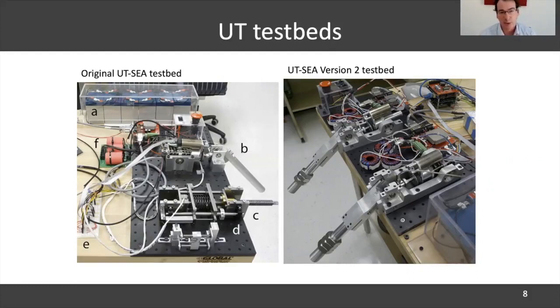In particular, here are side-by-side versions of a UTC without the springs and a UTC with the springs. The one with no springs had a piezoelectric sensor for measuring forces. The conclusion of these studies was that the elastic version has the benefits of shock absorption and is a great filter for force feedback control. These were great force feedback systems and allowed us to do great things, for instance in exoskeletons, which leverage a lot of the force feedback.